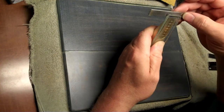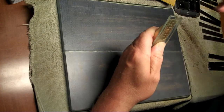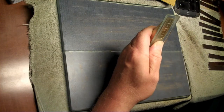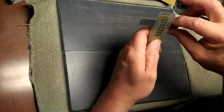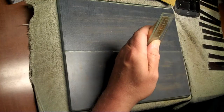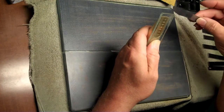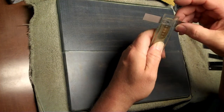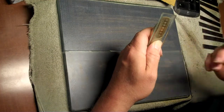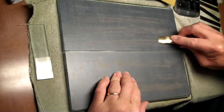Even up quite a bit. Yeah. And now the facing length from flattening the table is about 46. I need that to be 48. Let's check a midpoint somewhere. This 26 feeler should go down about 26 and a half, and it only goes down to 26. So I will be having to clean up the facing, take it down a little more.